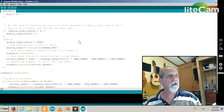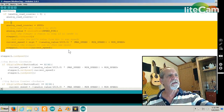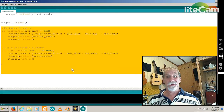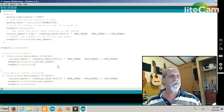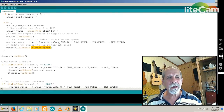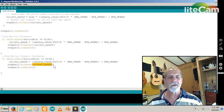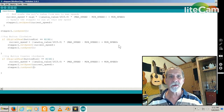Let's move on down. Here's their original code with the sign statements like I talked about. Now here's what I added — I took this else-if statement, edited it, and put this in. When I got it working I was so happy — it was exciting. What I did was add 'current speed' and put a minus in front of it for one direction — there's no minus current speed in the original code. I added the minus and it went the other direction. On the other button there's no minus. You can swap the negative to whichever button direction you want. My next video will show this working on the milling machine — I can't wait to show that to you. Thank you very much — happy Arduinoing!